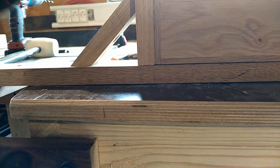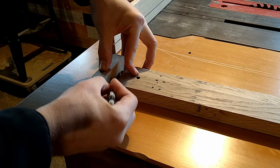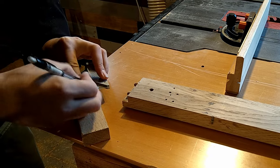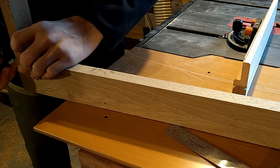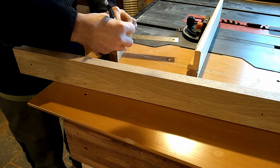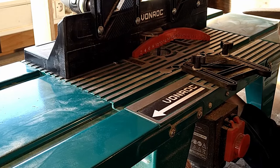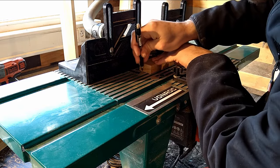Then there was this piece. This one will help hold the shelf top that doesn't have any legs and will hold it together with the other shelf top so they don't slip away from each other. It will be mounted where the old rabbet was. I removed most of the material on my router table doing it in a couple of passes — don't take off too much when using a router, just five or six millimeters or a quarter of an inch. Be patient and be safe.